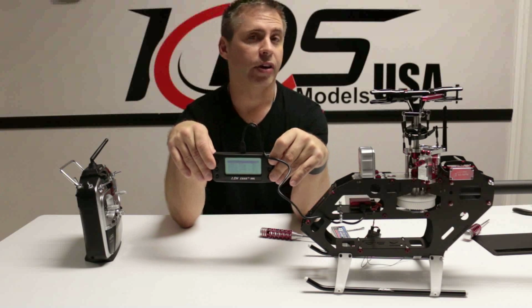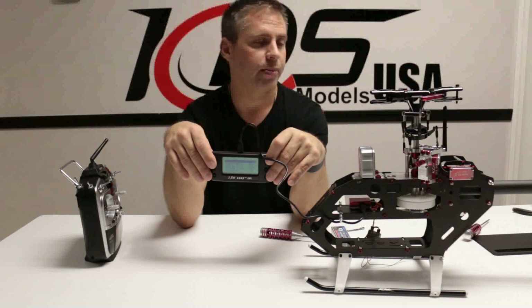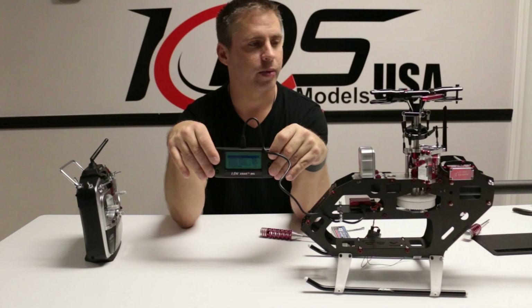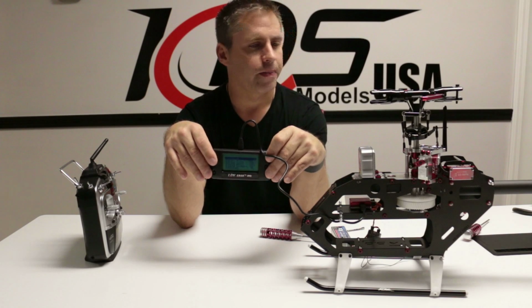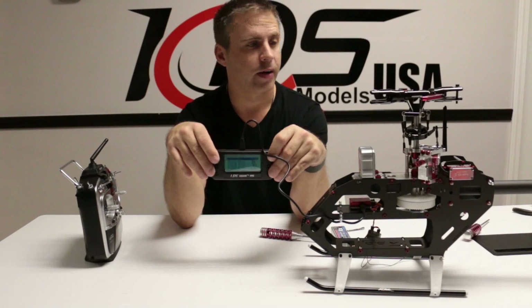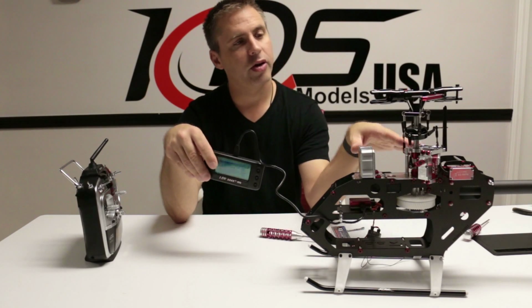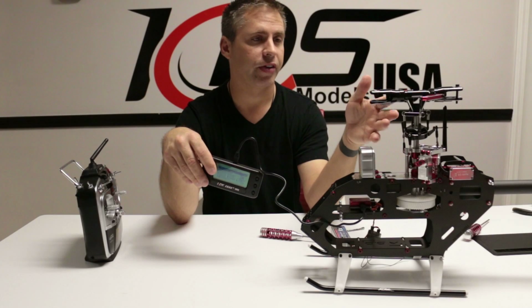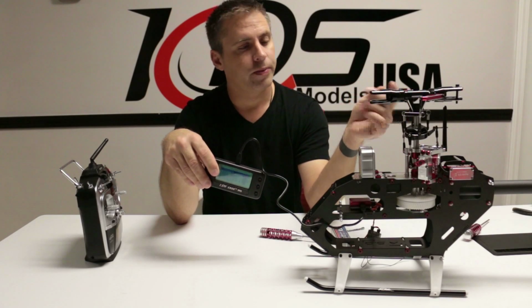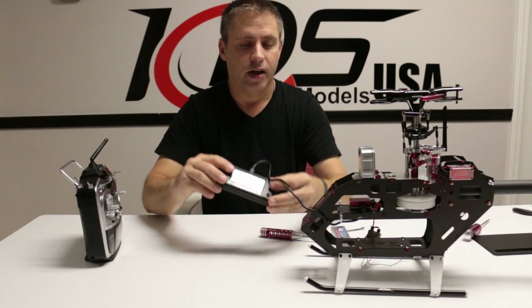I don't recommend going over 9, although we do find that a lot of guys in the 9 range are very happy, up to 9 are very happy with the performance. So anywhere from 8 to 9 depending on your flying style. Okay, so that's an easy thing to check. Now we've set our 0, we've set our maximum and minimum pitch, we've set our cyclic travel. So collective range is good, cyclic range is good.